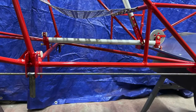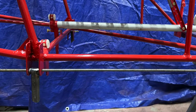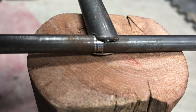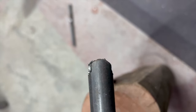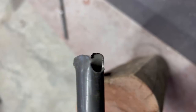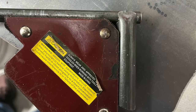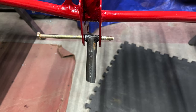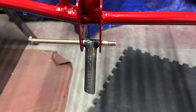I started by making both the rear one-inch legs coming from the rear gear fittings. These are 90 degrees from the 3/8 bushing material. I drilled a 3/8-inch hole through a couple of scrap pieces of 5/8 tubing left over from the fuselage, then trimmed the edges smooth. I bent those edges around a slightly less than 3/8 drill bit to give it the curve to hug the bushing material and welded them. Once welded, I drilled out the center to allow a quarter-inch bolt to pass through. One down, nine more to go.